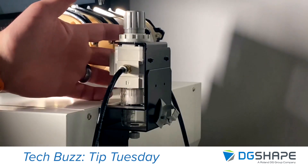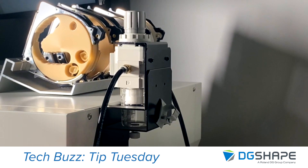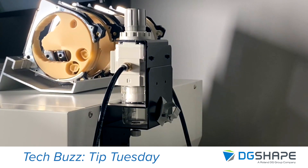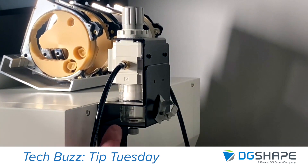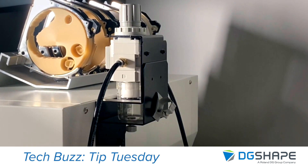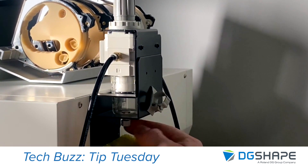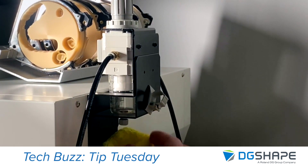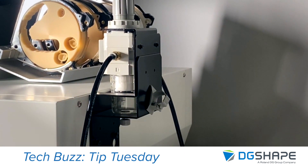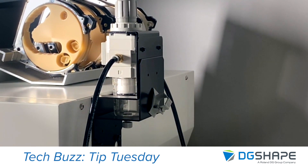The anatomy of this air pressure regulator: you have your input and output and your gauge on the front. And then here on the bottom, there's a bulb. Any moisture that's in the air pressure line is going to collect at the bottom of this bulb. This is something you want to pay attention to occasionally — just get your eyes on it and look for any moisture in that bulb. If you see any moisture buildup at the bottom, there's a little bleeder valve. With air pressure applied to it, you can hold a rag underneath and just pop this off and let it run out until any moisture that was in the bulb has come out into your rag. This is a periodic thing — maybe check it weekly — and make sure you don't have any moisture buildup.